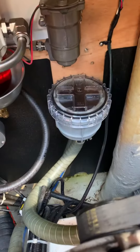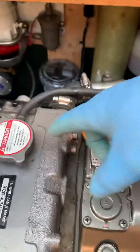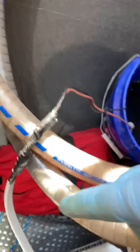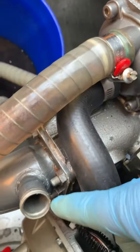This line goes from the raw water intake over to the raw water strainer, into the impeller — right there, you pull off that plate to change your impeller — goes through the heat exchanger here, cools the freshwater side of the system, goes out and up through this vented loop.